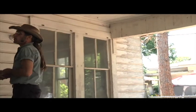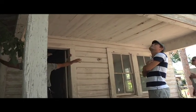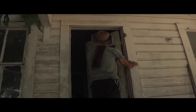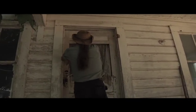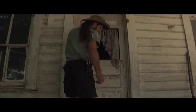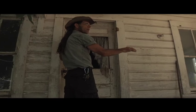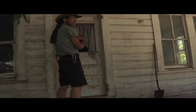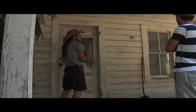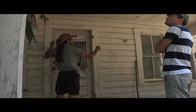As we look at it from the outside, one of the nice things about this house from the start is the squareness of it — this house is actually not majorly disturbed. When I close this door, it's not been chopped off severely; it's fairly square on the bottom and it actually closes, even though it's been beat up. This tells you the levelness of the front of the house is very good, which means there are probably not a lot of problems with the beams, the piers, termite infestation, or structural movement.